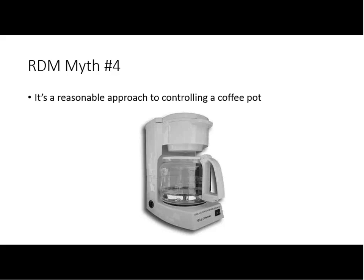Absolutely. Cool. A corollary of another question you had on WebEx is back to the pyro question. The question is, is E1.31 better for pyro because it's over Ethernet? Oh my God, that was worse. We'll get to that. But then that's a corollary question, which is would RDM be more suitable for pyro? No. No, it would not, because RDM is not a control mechanism, it's a configuration and reporting mechanism.